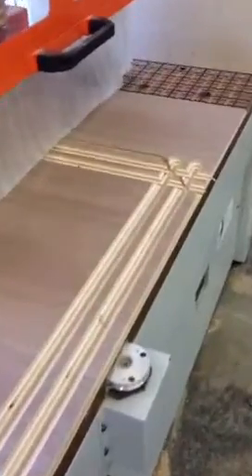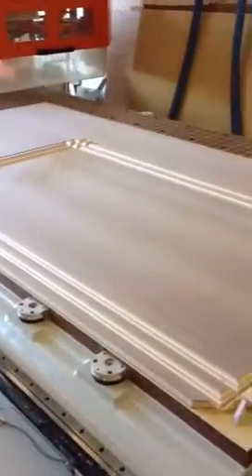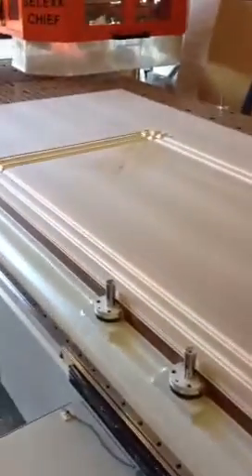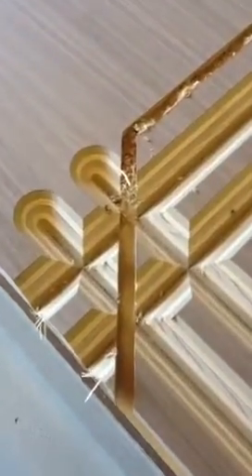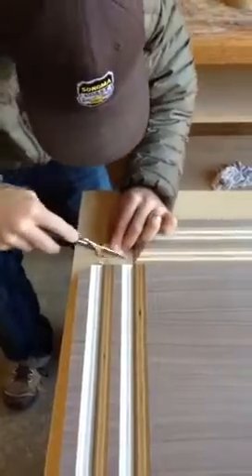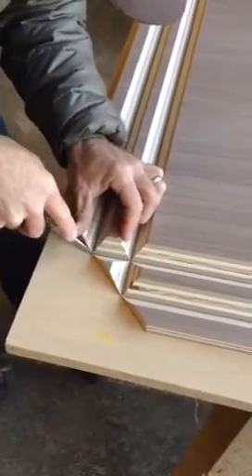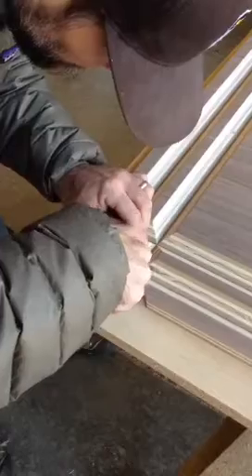It's going to continue around — there's one little piece that needs to be cut out with a razor knife. We're going to fast-forward over to the bench top. The machine's done; the pins came up, the suction's off the part, so we can pull all this apart. That one little piece needs to be cut out with a knife. Mostly what he's cutting is tape — since there's only a few thousandths of wood, that's really easy to cut. He's just cutting that clamping tape that rides underneath each one of those joints.